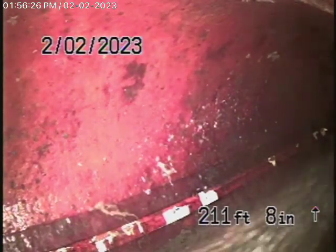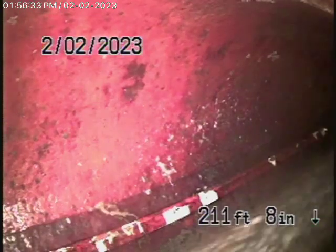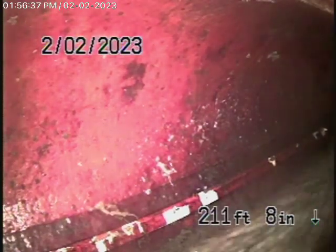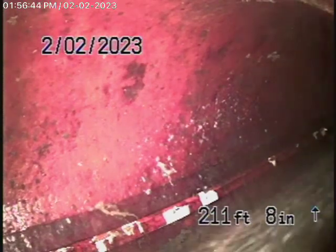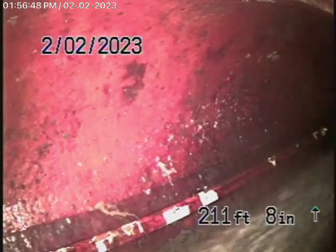What we've done is we're running our camera from this four-inch two-way clean-out located at the end of the driveway, which picks up the unit at the back, picks up the front unit. We have our camera in about 211 feet, which brings us all the way to the city sewer in the street. There's the city sewer — you can see it flowing by over there. We're going to bring the camera back.